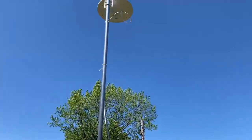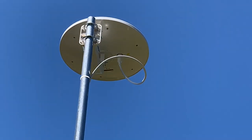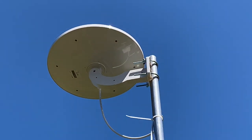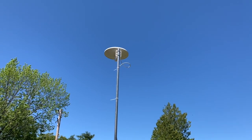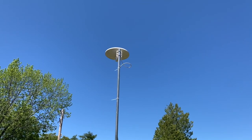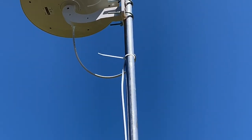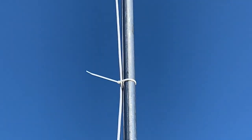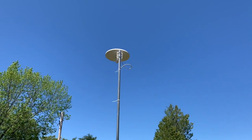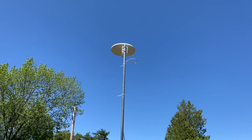Here it is mounted on a post in the yard, 12 feet in the air on a tripod. When attaching the antenna to the post, remember the mounting arm is plastic — you don't need to over-tighten the wing nuts, only tighten by hand; don't use pliers. The antenna is light so it won't move around much — just get it snug enough to stay in place. It's also a good idea to zip-tie the coax cable with a bit of slack to avoid unnecessary stress on the built-in RF connector. Find a mounting area clear of trees and as high as possible for best reception.